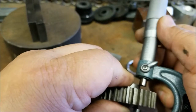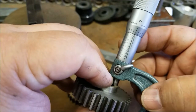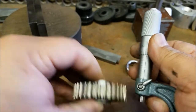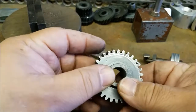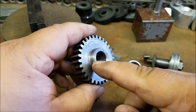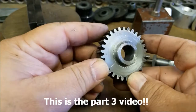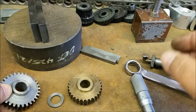So now with that information — how much did I make the gear? I was shooting for 805 and I'm just a hair over 805. Since the shoulder dimension we got 803 and a half and 804 and a half, we obviously have a thousandths interference fit, and that would lock this gear right up. So I'm going to have to go back to the lathe and just take a little bit off. I'll do that off camera since you've seen the whole machining in the part 3 video. So yeah, there's a quick lesson on using sliding parallels to get a transfer measurement.